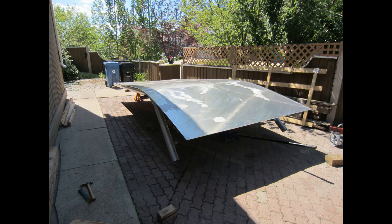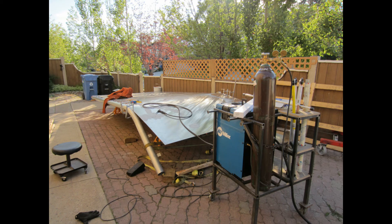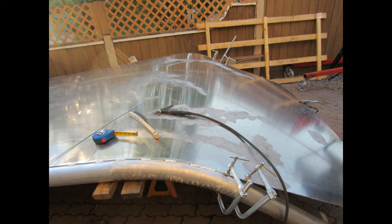The tubes were arranged on blocks and jack stands, and then the aluminum was placed over top. I used clamps to position it and welded it in place. All this went together pretty straightforward. The bottom sheet metal is 5086 and the tubing is 6061, but it welded up fine. I initially did just stitch welds and then eventually ran an entire bead across the whole thing.